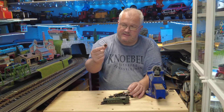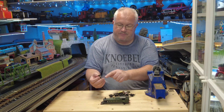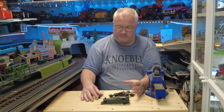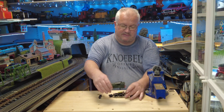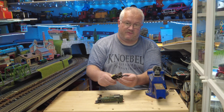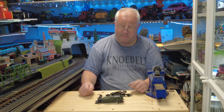I did wonder if it was the right chassis for the body and I believe it is — it's correct. You can see the crossheads and things all hanging off the chassis. It also looks like some of the brackets are missing to fix the body on. I've found one bracket off another Hornby model. The rods on here are slightly too short for this chassis so they need modification. We need to make some brackets — this is just a project to try and get this loco back into some sort of order and see if we can get it running and looking good on the layout again. Lovely weight, lovely looking loco. The motor's very clean — it turns over beautifully on the test track but it just needs a little bit of fettling.